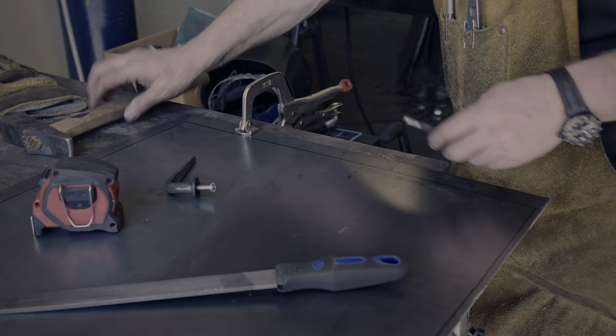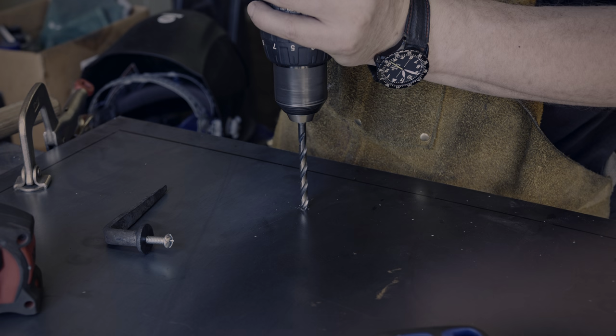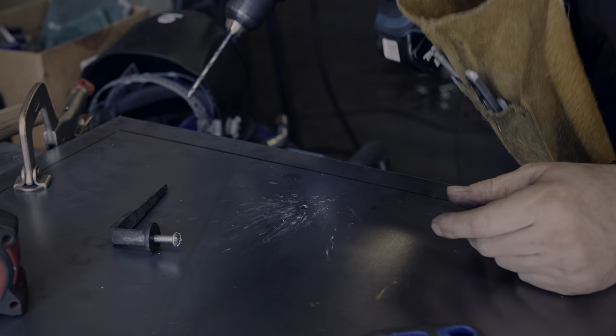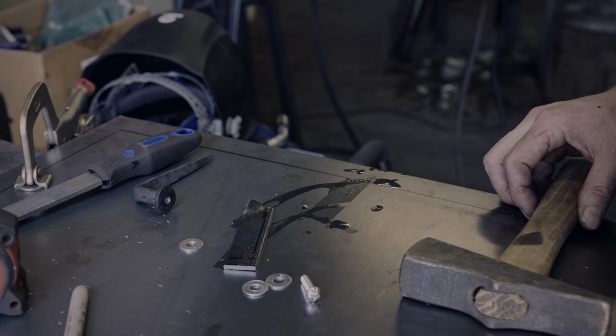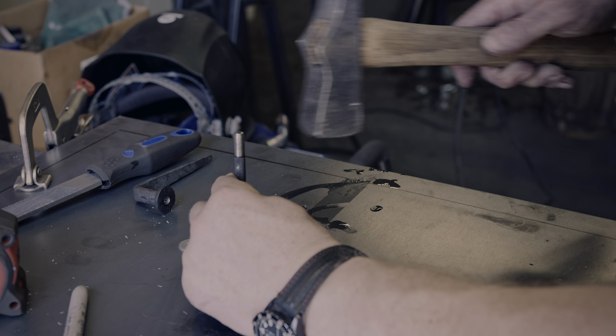One of the problems with this construction is that the sheet metal, while quite thick, is still pretty flexible. Ideally, I would have a bending brake to bend the edges to give it more stability. I don't yet know if that's actually going to be a problem in terms of creating a vacuum inside of the dust collector.